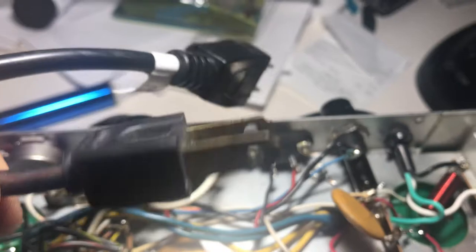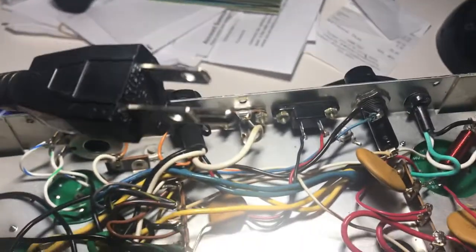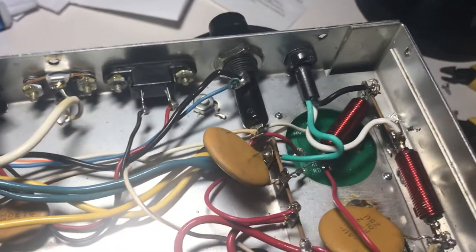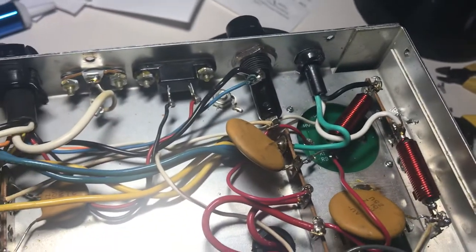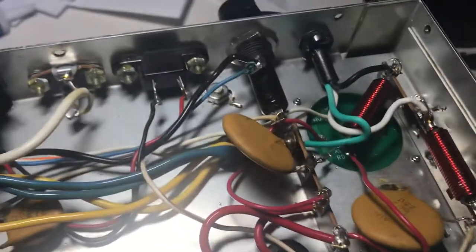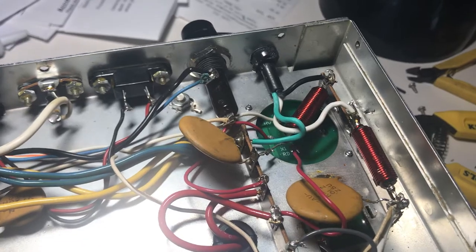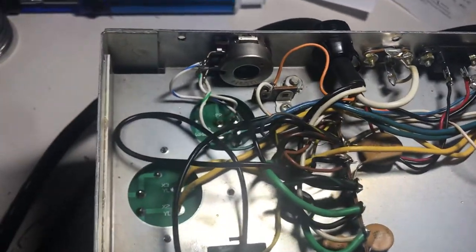I was thinking, why the heck am I going to find a three-prong power wire? And then I had some in the garage that were just used for PCs and such, so that worked out fine. I took another power cord part for some wiring. There's a second surprise to this power supply. People were saying that when you turn the Drake on, all the power goes through the switch in the Drake radio — the whole surge of this power supply — and it burns up the contact.